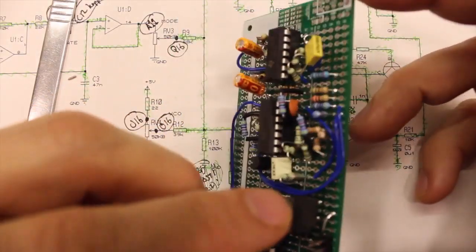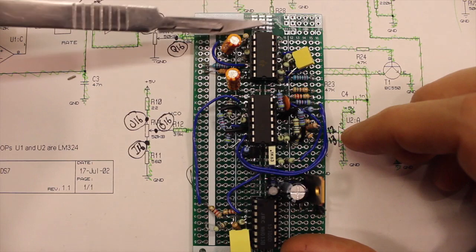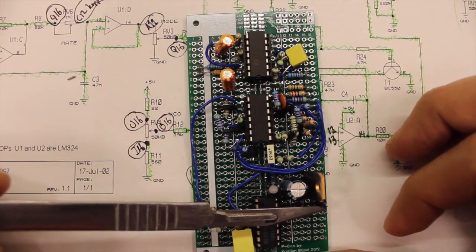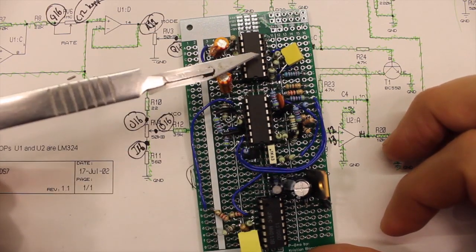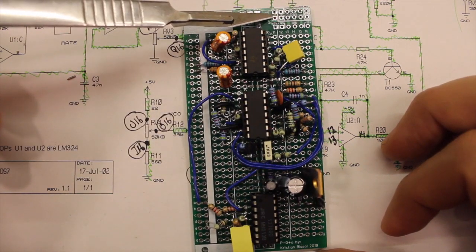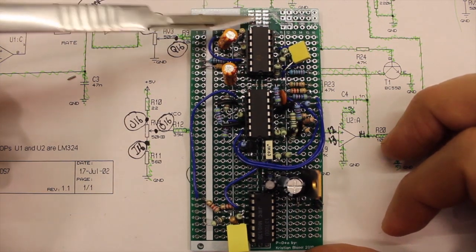Those are really good things to keep everything in order. It's quite a compact board and I also have the 7805 here because I need 5 volts. None of the power input pads I usually use are used here — I get power in as plus 12 volts and ground, then I just patch that into the central bus and get plus 5 volts and ground. If you have a plus 5 volt Eurorack power supply, you can patch that into any of the central buses with this little pad over here.